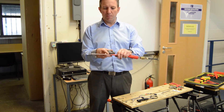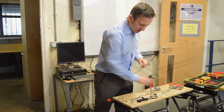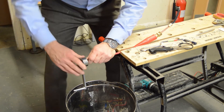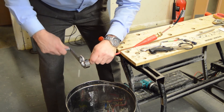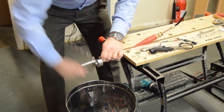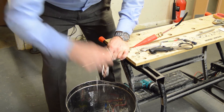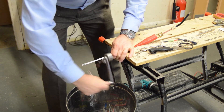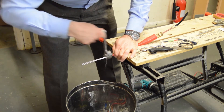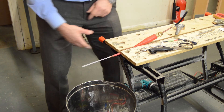Once we do that, that will give us the perfect length of cable to go between the two accessories. So we'll now strip the cable. We've put our cable back into our workmate, holding the cable with your left hand, supporting it as much as possible. We're going to shove on, making sure it starts cutting, and we're just going to move our left hand away as we go, exposing the conductors. If the outer sheathing gets too long just fold it over, keeping our hands moving, supporting the cable as much as possible, and eventually the outer sheathing will stop the joint stripper, allowing you to remove it.